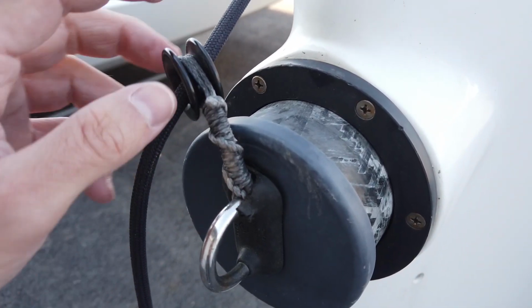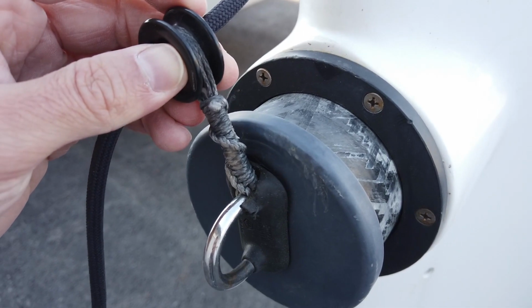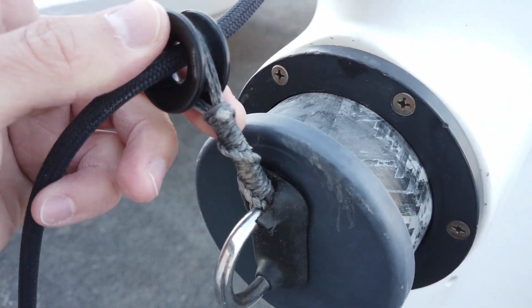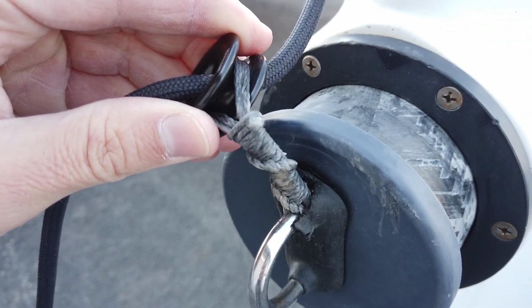In connection with the bowsprit, there are 2 key checkpoints. Check that the lashing fixing the thimble of the Gennaker tack line is not stretched too much and still in good shape. This one is still fine. What you're looking for is if the thimble could slide out of the lashing.